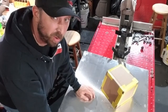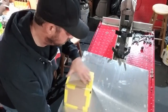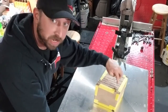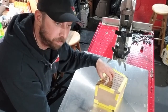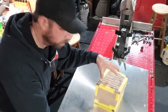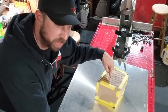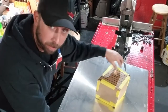With any luck this weekend, I'll go weld it all together, except for the top piece — I won't weld that on yet. I'm going to go ahead and put the holes in it for stuff, but I don't have the pump yet. Once I have the pump, I can make the mount for the pump, and then finish weld and put the top on. By putting the top on last, that'll allow me to fully weld outside and inside the fuel cell, and then the top will just be outside welded on the perimeter.